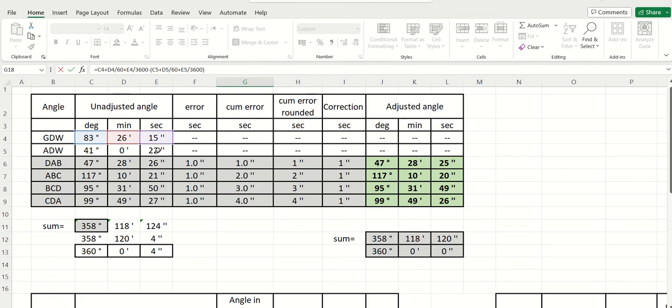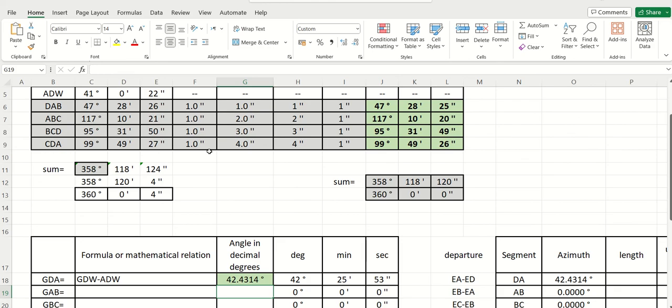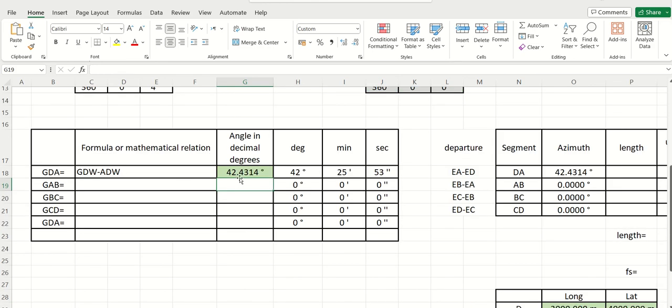For your case it's easier if you are using your calculator, as it can switch automatically from degree format. What I would like to stress is that if your calculator gives seconds with decimal digits and your precision is the second, you should round. This is mandatory because in your traverse the precision is the second. If working in AutoCAD, set precision to four decimal digits, because four digits gives you the ability to define the second precisely without introducing additional truncation error. The result is 42.43 degrees.